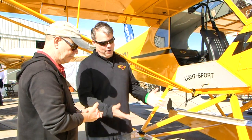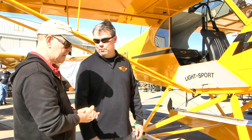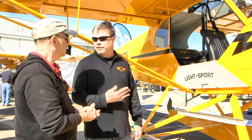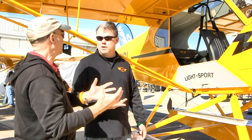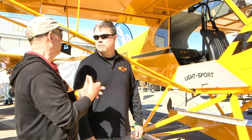These are carbon fiber composite floats — carbon fiber and Kevlar construction — and we use honeycomb. The reason we use the hybrid fabric is because of the impact resistance you get combining carbon and Kevlar together. If you hit a stump or a rock, you don't want things to shatter — that's where the Kevlar comes in. Kevlar is used in bulletproof gear, so if it can take a bullet, it can probably take a rock.